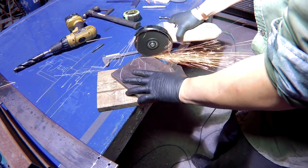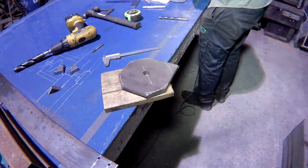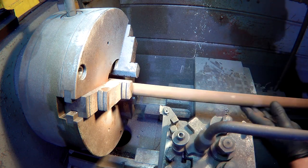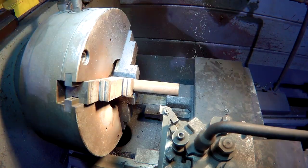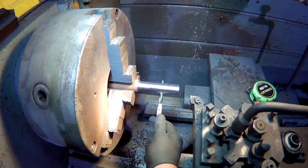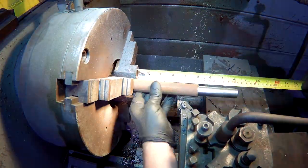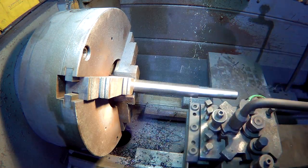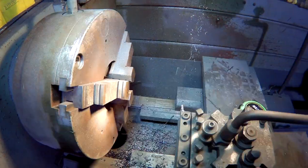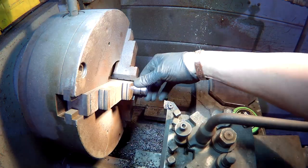Quickly trimming off the edges here just to make it a little bit quicker and easier to turn down once I put it onto the lathe. I'm using some 25mm steel round stock to make the shaft for the hub. First I'll turn down this end to around 20mm for the two bearings to fit over — this has to be a nice sliding fit, nothing too tight. Now I have the right fit for the bearings, I'm using a strip of emery cloth just to clean the rest of the shaft. Then I'll part it off to the right length, spin it round, and turn the other end down to fit into the hole of the hub plate I had just previously made. I want a nice snug fit so when I push it into the plate they're pretty much square with each other. Then I'll weld it up and bring it back to the lathe and machine the hub to the right diameter.